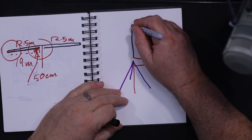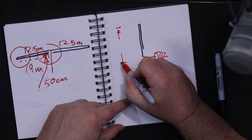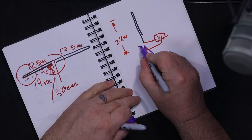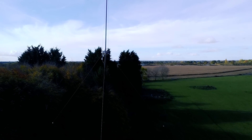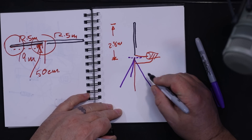I had a linear-loaded 15-meter element that went up and came back down because I was working with 2.8 meters of space. This was on an 18-meter pole — I had 2.8 meters from a certain point to the very top — and I wanted to make use of that. So I put a vertical up for 15 meters and it tuned perfectly on 15 meters.